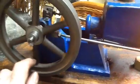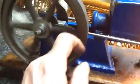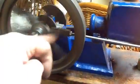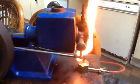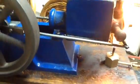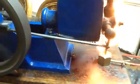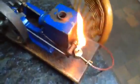What we've got then is a form of scotch yoke to create a cam follower. But this is where all the noise is coming from, and there's a lot of energy being lost in that tension spring to return the shutter. So I'm going to go with one of those Desmo cams I showed on the forum a few days ago.